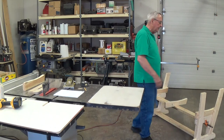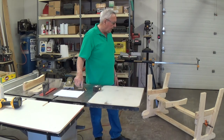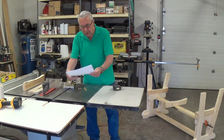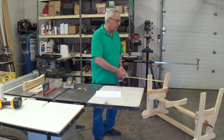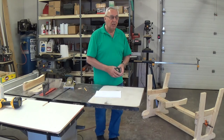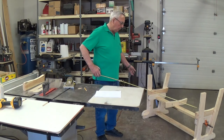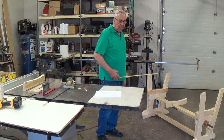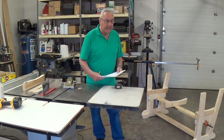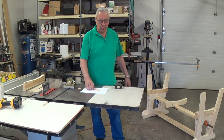You'll notice there is a right and a left side for this system too, but common sense will tell you that as you're building it. The overall width of this thing when completed should end up at 58.5 inches from the very outside of the armrests, which would be sticking out about another 4 inches on each side. If you choose something a little wider or narrower, you can adjust that with the 2x4s that hold the base together, and as a result you would either lengthen or shorten your 1x4s that make up the seat. Whatever you do to one you'll have to do to the other so they both match up at the armrests. I think we've covered everything for video 2, and our next get together will be video 3 where we'll be actually building the bench itself. Thank you.